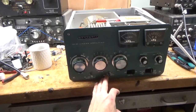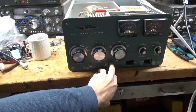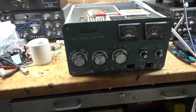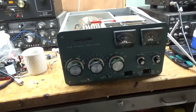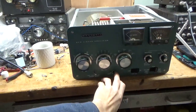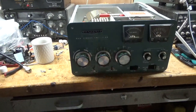This one has some sort of modification where it puts a resistor in series with the primaries. I kind of like a soft start, but it's not needed in these things. Also, all of the current is carried through this switch, which isn't a good idea — it's not rated for the current.